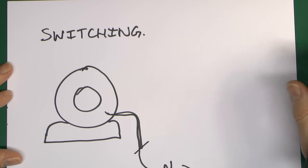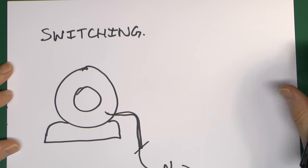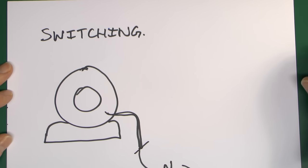Any kind of inductive load can cause this sort of thing. And so can pretty much anything else — even capacitive loads: switching those on and off causes disturbances on the electrical wiring within that building, and even in other buildings in some cases. Switching of various loads can and often does cause transient overvoltages which can cause problems for equipment elsewhere within the installation or even related nearby installations.